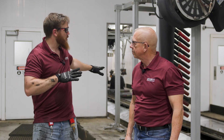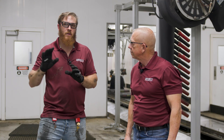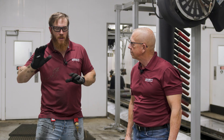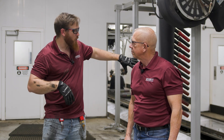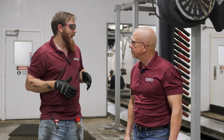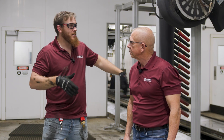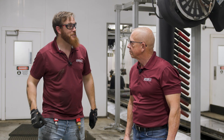Now we're going to tackle the carryway. We're going to get underneath to get the structural grating and clear out everything that's built up underneath. Then we're going to spray down through the slots and the wear plates to clear all that out, get all the stuff blown up through the wear plates off the top, and then spray everything that's now built up on the drip trays down into the center of the trash.